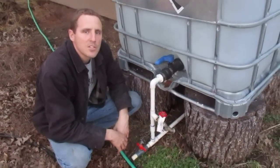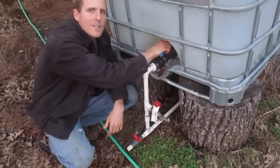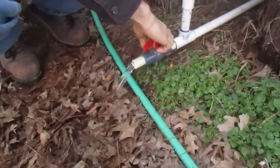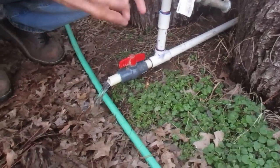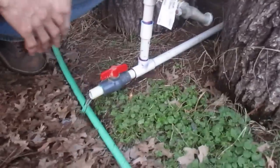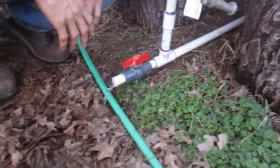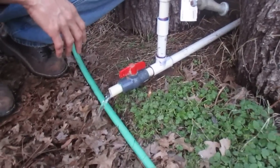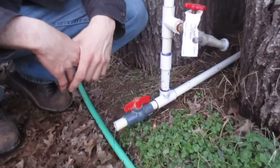This will hopefully be the last shot of the night. What we've got here: we're going to go ahead and shut off this valve, which is what we need to do to isolate our rainwater collection tank off of the gutter system. Then we're going to open this drain because we want to drain this water out at night when we know it's going to get below freezing — for us that'll be 28 degrees or lower. We've proven that the water itself can handle being frozen, but the pipes themselves are a weak link. So that's why we redesigned it with this drain system. Hope you enjoy the video, thanks for watching. Shalom.